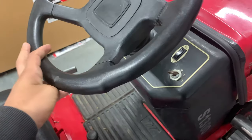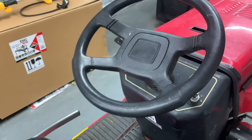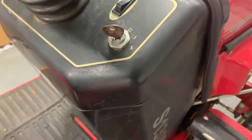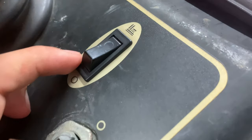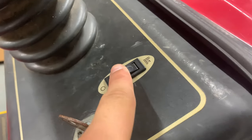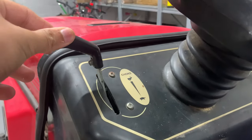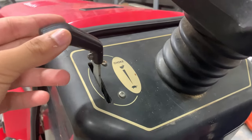We have a steering wheel, which is the biggest thing here. The steering isn't very light and it's not heavy — it's just right for a lawnmower. Underneath that on the right side we've got the ignition. Here we have the mode selector: when it's like this you can drive it on tarmac, and when it's like that it's for cutting grass. On the left side we have the choke — you have to start this tractor using the choke, and you can use it while driving but it's best to leave it in the middle.